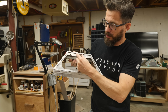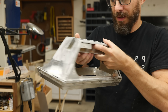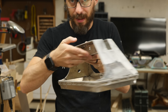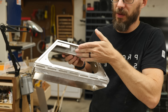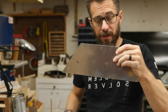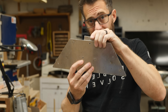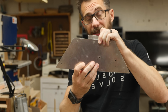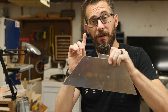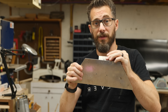The next step is to figure out how to put this removable panel on this front face. You'll notice I cut a little section out of that, and that's because the bolt for the foot needs to go in here, and I need to be able to tighten it from the other side. So if this top section was in place, you couldn't get to the head of the bolt. The way around this is to take this panel and put the tab that I cut out of the frame on top — this gives it an alignment so it can slide in and snap into place. Then we'll use some magnets on the bottom. First step: let's get this fit and get this glued with some JB Weld.